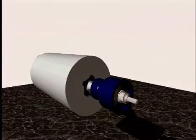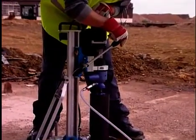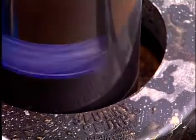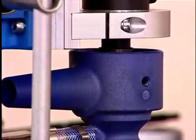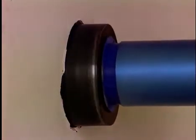At maximum size, the use of a rig is strongly advised. The resulting waste material is then fed into the wet vacuum cleaner via a slurry collector for later disposal. Let's see more of the multi-swivel theory put into practice. For small holes up to 80mm, a pilot hole is drilled and a starter plug positioned. Once the hole is started, the plug is removed and the hole completed in one action. Standard extension rods are available for deeper drilling.